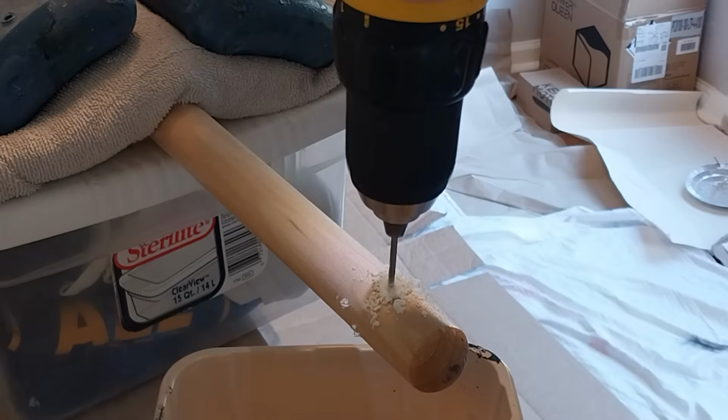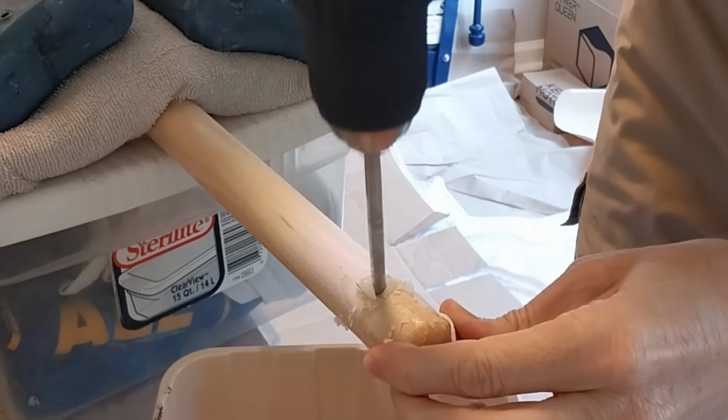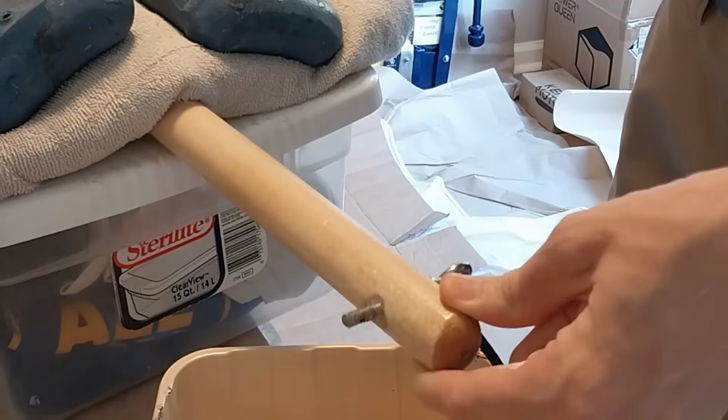This hole I'm drilling is what's going to allow me to attach the 2 halves of the Windvane together with a pin. This way it can easily be taken apart when trailering the boat on the road. Here's a test fit of the pin I made.